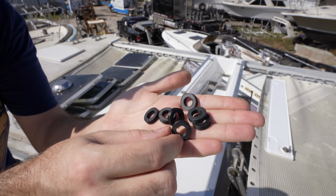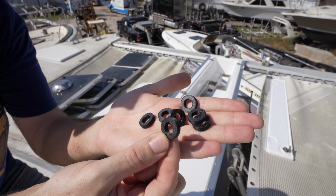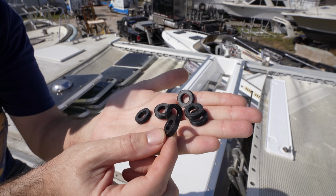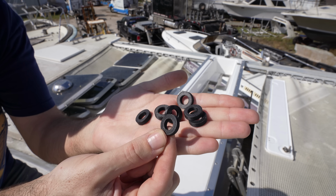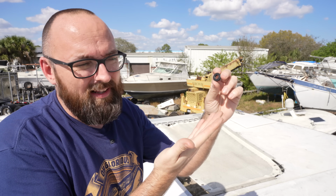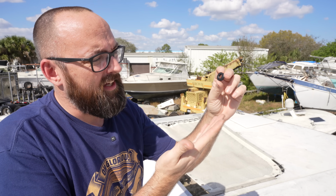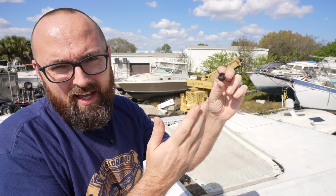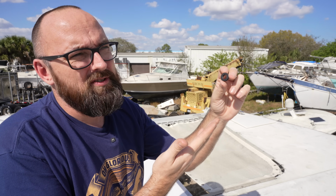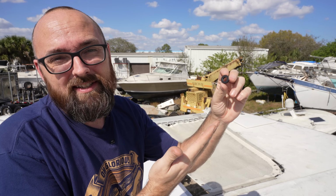These are custom designed 3D printed little spacers that are printed in a filament that can best be described as the Superman of filaments for functional 3D prints. This stuff is called PPA-CF and it is kind of like printing with metal. It is freakishly stiff, it doesn't care about sunlight, UV damage, or humidity, and it's high temperature resistant up to something like 227 degrees Celsius.